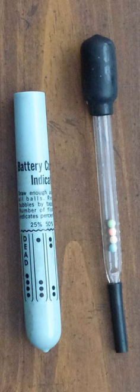The hydrometer makes use of Archimedes' principle: a solid suspended in a fluid is buoyed by a force equal to the weight of the fluid displaced by the submerged part of the suspended solid. The lower the density of the fluid, the deeper a hydrometer of a given weight sinks. The stem is calibrated to give a numerical reading.